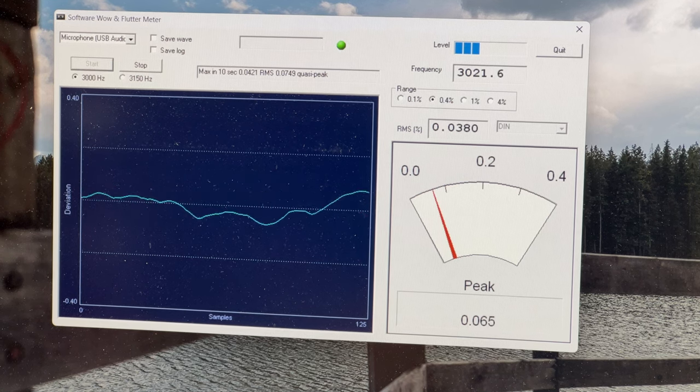So yeah, the first one I tried on it was this JVC G160. I don't really care about this tape. I just wanted to use the JVC tape and the JVC deck just to see what happened, and I did a test recording on this. I did the same vaporwave recording that I used to test this out earlier, which is Cat System Corpse Turns to Gold from the Blue Dream album. And yeah, it had no problems working with this tape, but I should mention in here, you can see it's got suggestions for how far to drive the meters if you've got various tape types. And what I found was this tape couldn't go as far as the marking was. It only goes to about plus 2 decibels, and that's about all you can get out of this without it distorting.